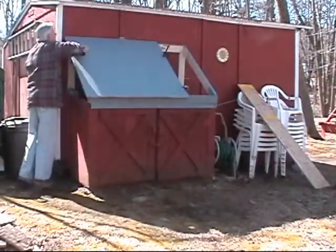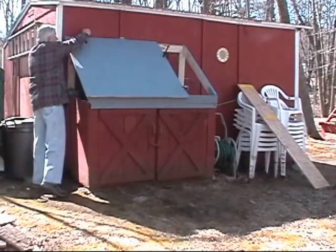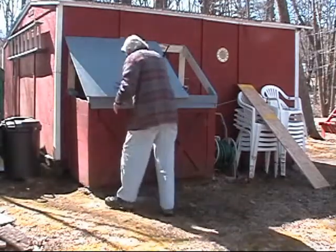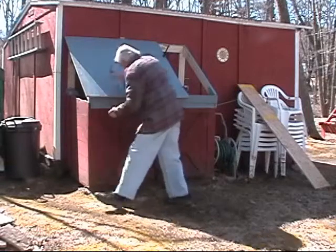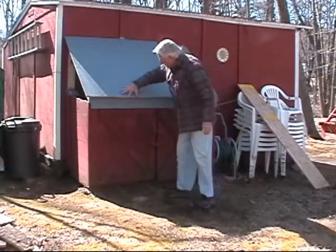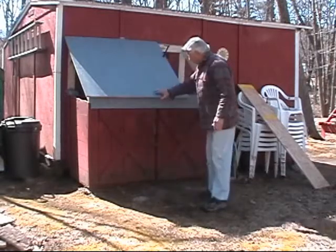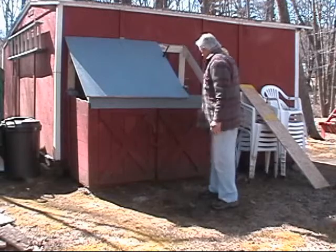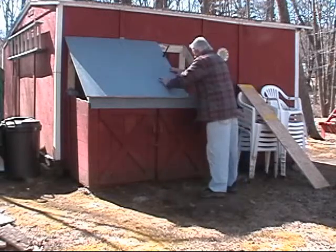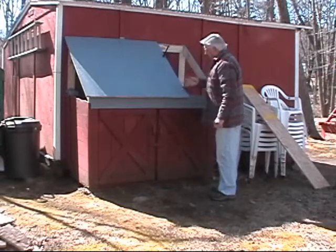All right, let's see how tight I am up here. I'm tight up here. The caulking will go up in here later on. And we're painted — we're primed underneath here. I just got to trim this edge so we're coming down on an angle rather than a 90-degree cut. We've got to cut on an angle — I think it's 34 degrees, something like that. We're going to nail this onto the two-by here and we'll be all set.